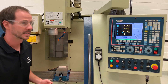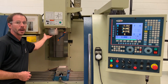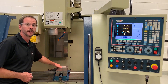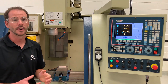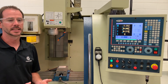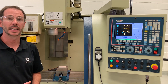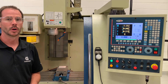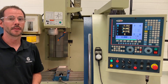Another way that is commonly practiced is we measure the distance between the bottom of our spindle and the top of our workpiece. That becomes our fixture offset in Z and then our tool length becomes our actual length of our tool. There are multiple varieties of ways that you can take your tool lengths and that's fine — just make sure that you are doing it the way that your practical professor has shown you, as it may be different than this video.